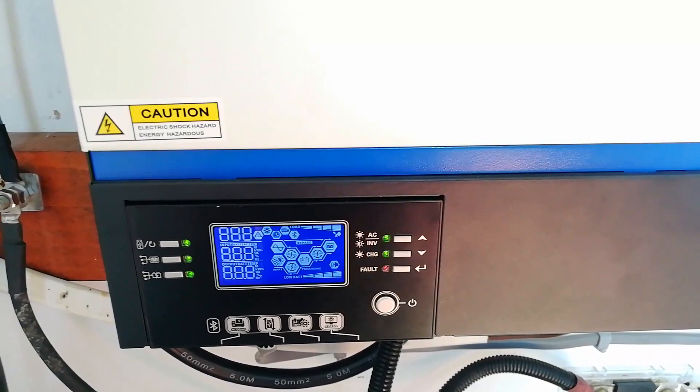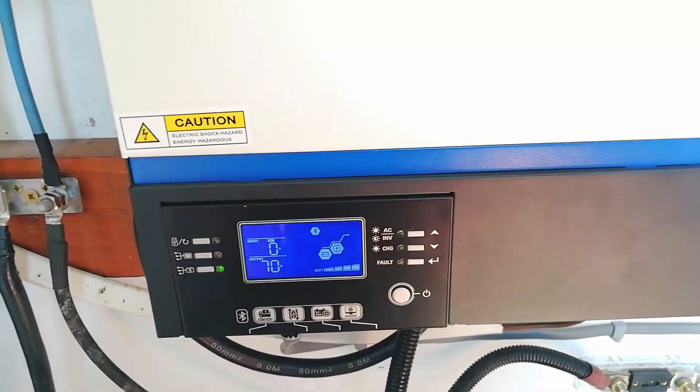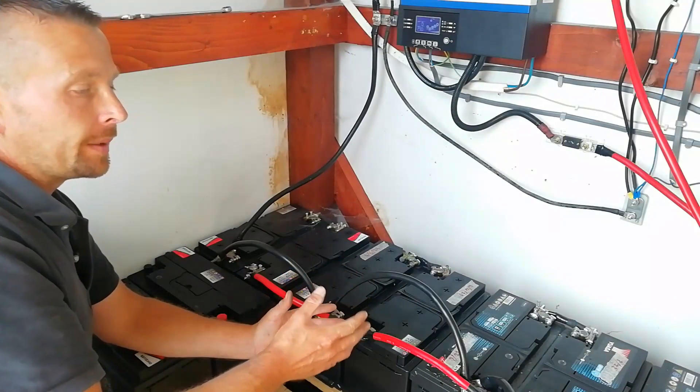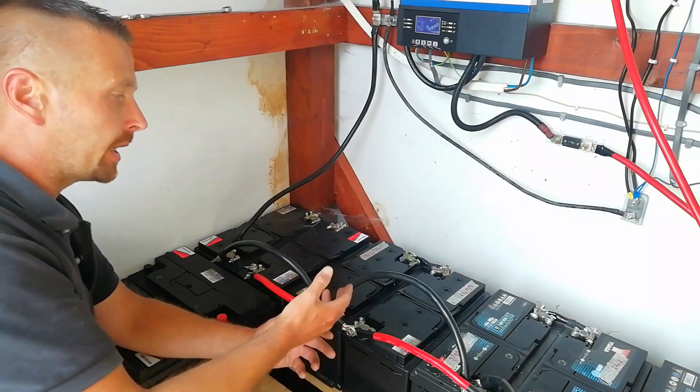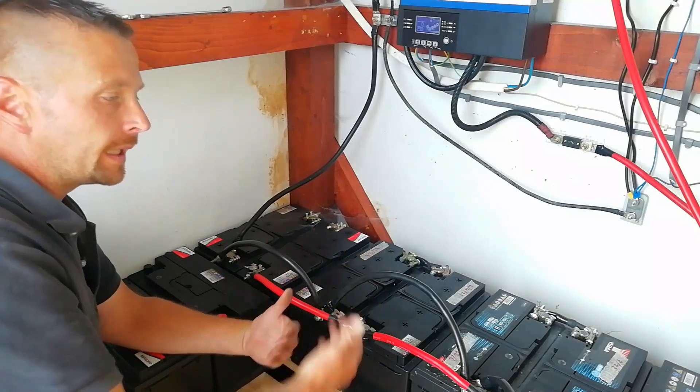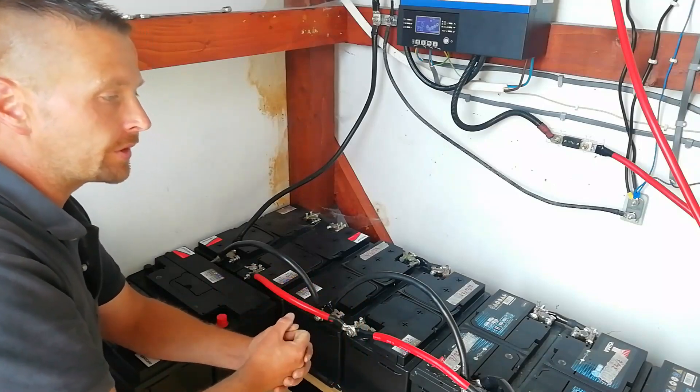The inverter is now fully connected and back up and running again. The next thing you'll need to do is re-equalize your battery bank. Over time some of the cells can get pulled down — some might discharge faster, some might charge at a different rate. That accumulates over time and can end up pulling the entire bank down if they're not getting an equal level of charge.